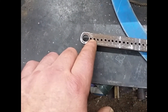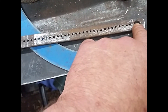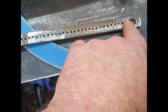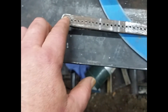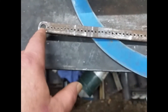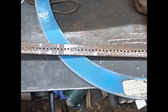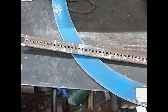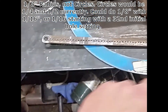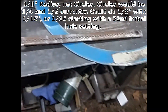From that hole to that hole is three-eighths, and from that hole to the hole that's not there — but anyway, that would be a quarter, so that's a half-inch from here to there. So: half, three-quarter, one-inch, and then three-eighths, five-eighths, seven-eighths. Depending on which end you put your torch in, you can get all the way down to one-eighth inch increments, depending on whether you cut from this side or that side. And as you saw, that worked pretty damn good.